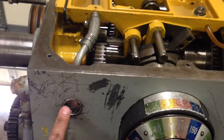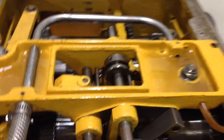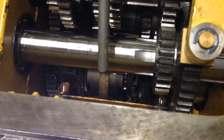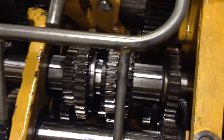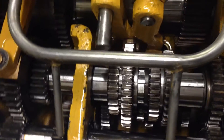I got a new sight glass — my old one was all milky. Another thing I replaced was the clutch rollers. The very early clutch rollers in mine had small needle bearings, and every one of those had broken up. You can just see one of the broken clutch rollers down there. The later ones Colchester changed to a bushing design — a solid outer roller on the same steel pin as the original ones.